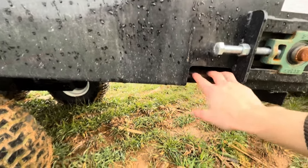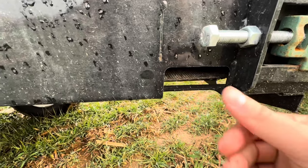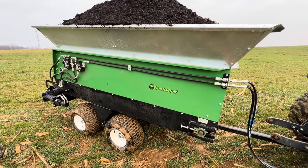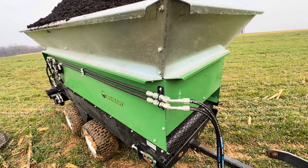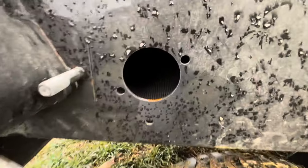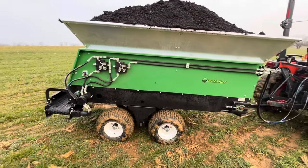You want to clean out under here with your pressure washer. You don't want this dirt in here — it's obviously loaded right now, so that's why it's a little bit dirty. You want to be sure that you clean out that dirt. You don't want it sitting in there, packing into this roller, packing into the belt, making a mess, and ultimately throwing your belt off. You've got another clean-out back here where you can see the inside underneath the belt. You want to keep that underside clean.